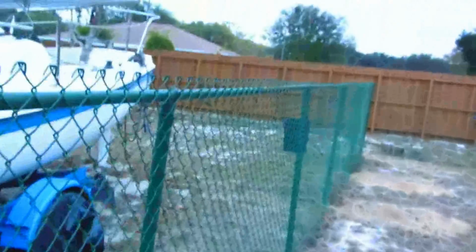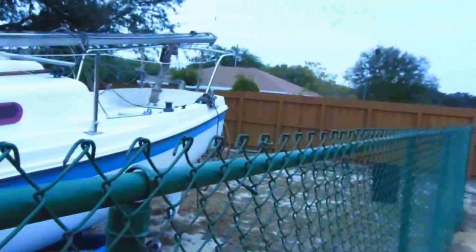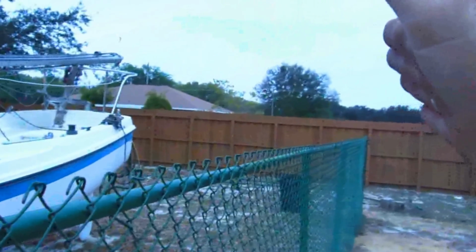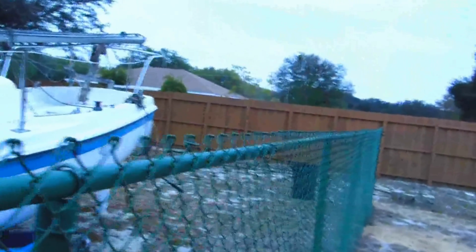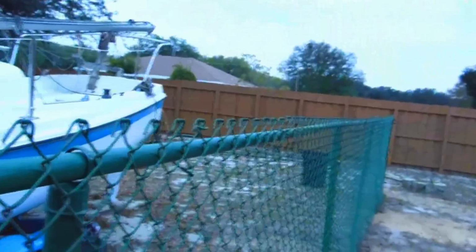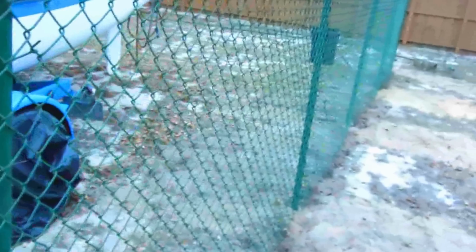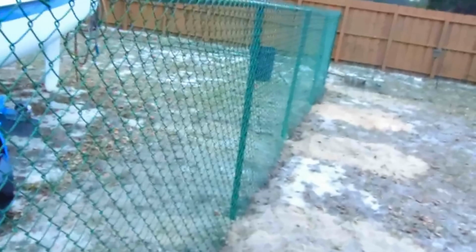And then what I'm going to do across the top, I think I'm going to use rebar from here, bend it, come up here, and use a heavy wire going between each one of them. And it'll be in about that much from these poles. And I'll just use a nylon fence on the ends over that, and just put it on with ties. And I'll put the rebar on with zip ties, but these are real heavy ones. They're like 1/2 inch. I'll use 3 or 4 of them on each one, so they'll hold up anything. They're strong, like steel practically. They're very thick, so that'll probably hold it up pretty good. And that should be good enough.